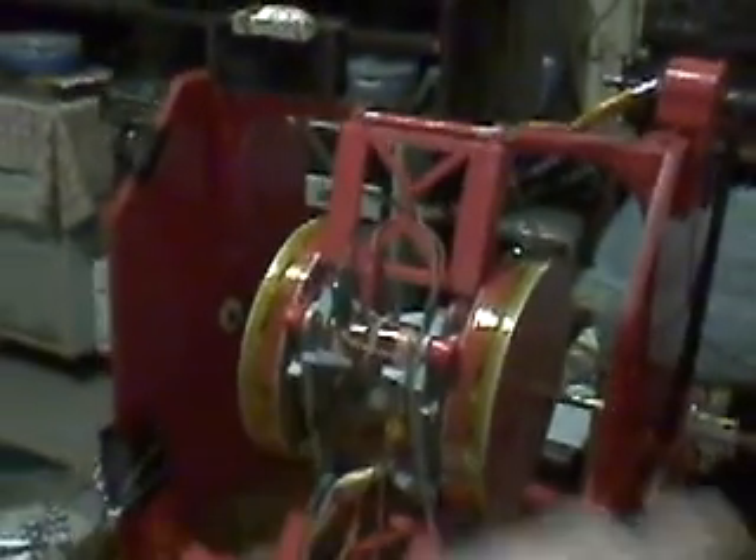I wanted to do that test because I'm moving on to the next stage with the rotary system. I'm going to use some TRIACs to switch in the exit point as the rotors move away from the actuators. I'm going to use these coils, which are currently being resonated, as my trigger coils to drive the TRIACs — so that when the rotor moves around and enters, it will trigger the TRIAC, which will start switching the secondary output coils into circuit to drive the output.